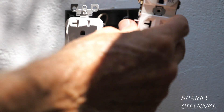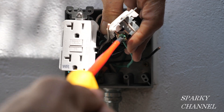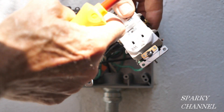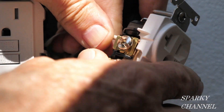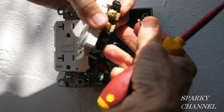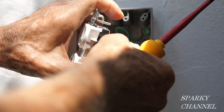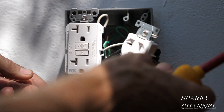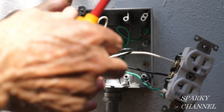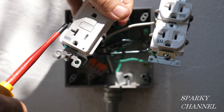Now we're going to hook up the adjoining receptacle. I take the ground wire and put it on the green grounding terminal of the weather-resistant 20-amp receptacle and tie it down securely. I've got my white on one side and my black on the other — the white neutral wire goes right here, and the black hot load wire goes right here. I tighten this down securely and give everything a good tug. So to review: we've got the ground wires going to both receptacles, the line cable going to the upper part of the GFCI, and the load cable going to the lower part of the GFCI.